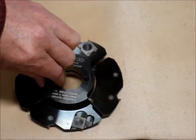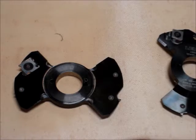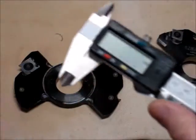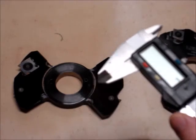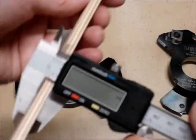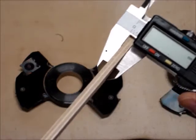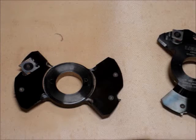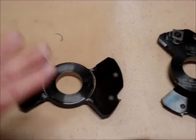The way I set this up is I want to measure the thickness of the spline I want to use. And if you do not use metric, if you use an adjustable groover, this is the time to use metric. It's like 5.92, 5.90, 5.91 — looks like about 5.9 to 5.95mm is the thickness I want.